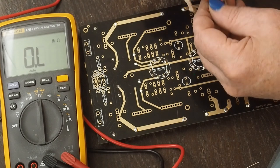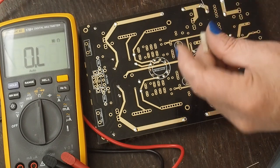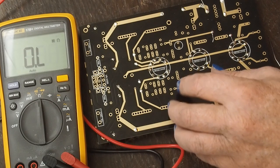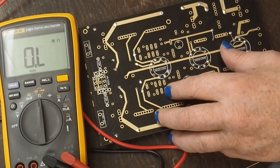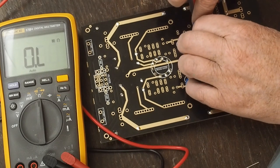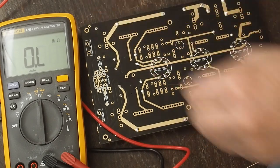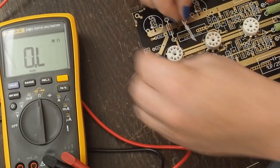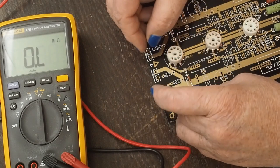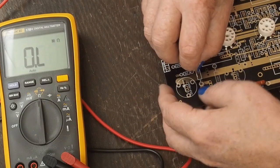Never take for granted that what's on the resistor or what's in the bag is what you're putting in your project. Because hasn't been often, but I've run across a couple of resistors that were just way off. And when they're manufacturing these things, I don't know, but I'd be shocked if they were testing every one they make. But again, I don't know how they make them. They may make them all and then sort them by their values later. Never been to a resistor manufacturing plant, so.